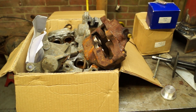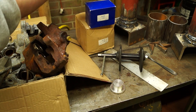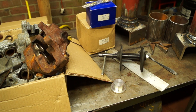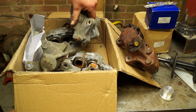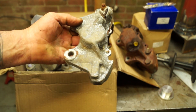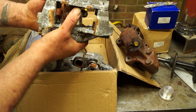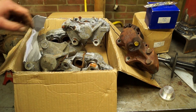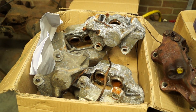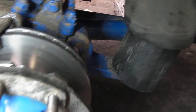Thank you to Mario who's given me a box full of calipers. I have a piston spreader and some fittings for putting pistons and seals in. I've got front and rear kit for overhauling - it's either a Disco 1 or a 90. This is a full axle set and the calipers are not in bad condition - there's only light corrosion on them and I think these are worth overhauling. These are 41 millimeter pistons and the tool I have here fits in, which we're going to use for putting the seals in. This will be in a tutorial later. Brakes are brakes whether they're on trailers, trucks, or Land Rovers - it's all the same thing.